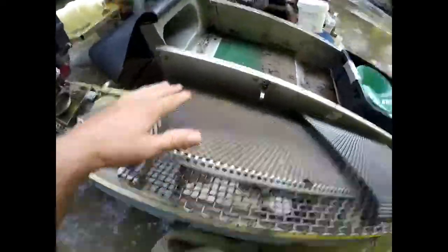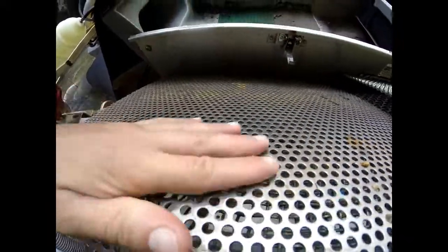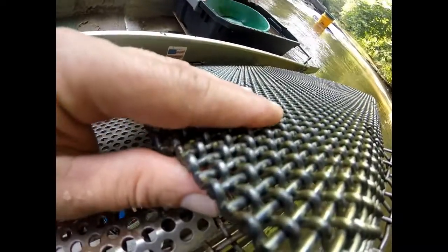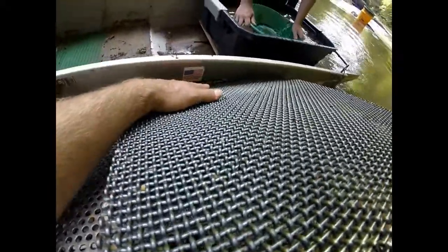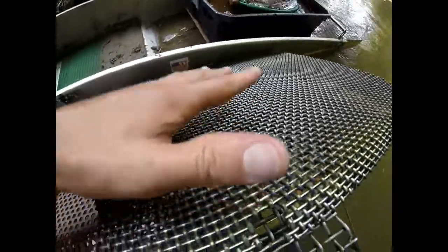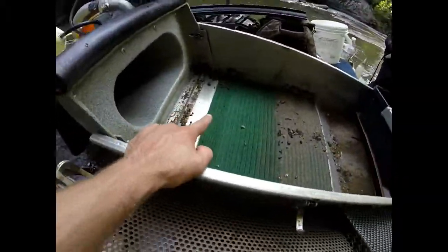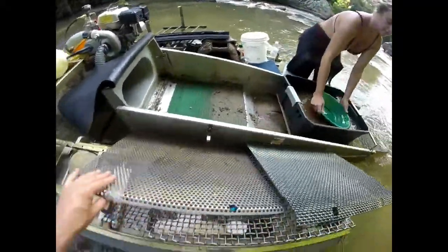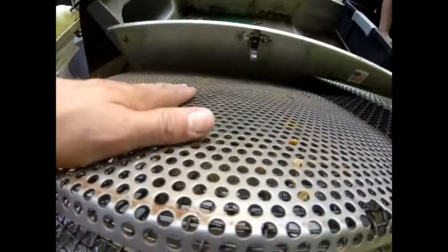Here's your traditional punch plate — you see it's flat and smooth. This is what I'm talking about as the woven back screen. See how the metal is woven? This creates so much drag and pull with gravity working and the water. It's like a suction on the top of this. I'm really seeing almost no gold in the back top part of the sluice — it's all making it down here. Guys, if you don't have one, you've got to get it. Make sure you have it for the top too — you don't want punch plate in the top anymore. This quarter-inch woven back metal goes down to eighth-inch for the triple sluice. Big difference. I'll never use a flat punch plate again — never.